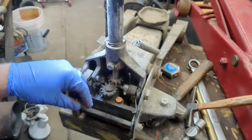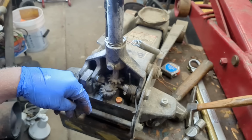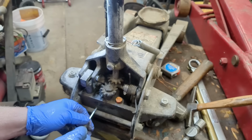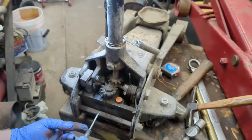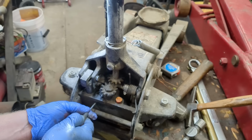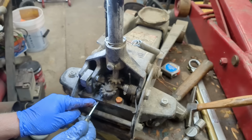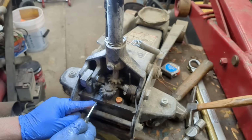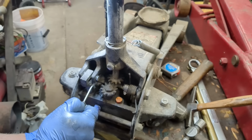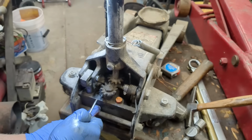So gravity, the weight of the check ball. Sometimes they stack 2 check balls for weight, one on top of the other, just to weigh the other one down. Just holds it down. So when you pump pressure in, it pumps from the bottom, pumps up, those check balls move out of the way for a second, fills up the piston, and then the check balls fall right back down. And gravity and the pressure from the main piston and the weight of the vehicle or whatever holds those check balls closed. That makes sense?